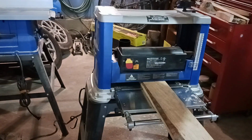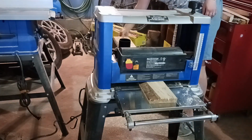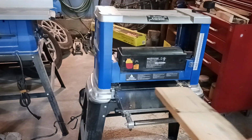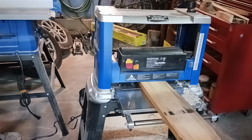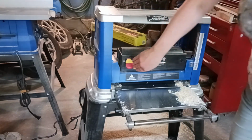It's important to use your safety gear when you're using tools, so get that first. Then we can start by planing our boards. This is especially important if you're using reclaimed wood because it can definitely be a bit rough. Here I'm using a thickness planer, but you can also use a hand planer or sander if that's what you have. Planing the wood removes a lot of the wear and the weathering, and it gives it a uniform thickness and texture. This makes sanding a lot easier later on and saves a lot of time and energy.